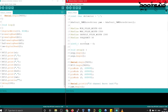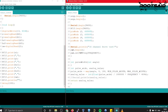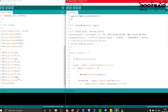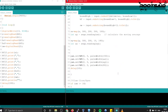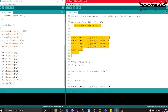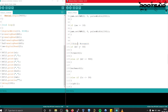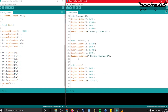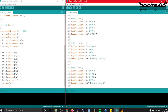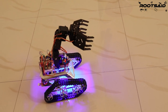On the robot side, the HC12 wireless module in the robot will be receiving the data that is sent by the remote controller and send it to the Arduino. Arduino then separates and stores these values in different variables. Once that is done, we can simply use these variables to control the robot as well as the robotic arm if you are using it. We have made a detailed video explaining all the coding part for this robot, and I will link the link in the description down below. Once you have uploaded the code to the Arduino glove as well as the robot, you will be able to control your robot by using your hand gestures.